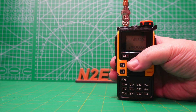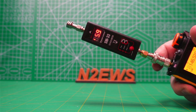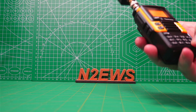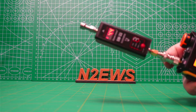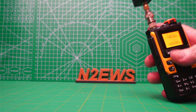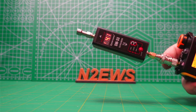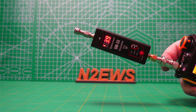Now let's take a look at the power output. On two meters we're getting about 5.8 watts, which is above what it's rated. On 70 centimeters we get 4.4 watts, and on GMRS channel 16 we get 3.9 watts — 3.9 watts and 4.1 watts.